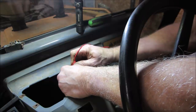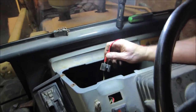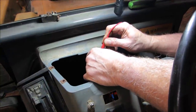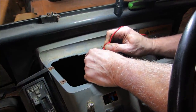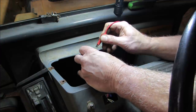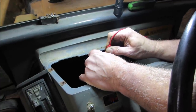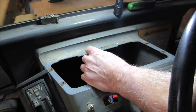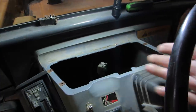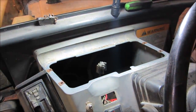The radio comes on. Tries to. And the radio blinks. And if we were to make power going on. So that's a dead short. Wherever that's going, it's going right to ground. So something's an issue with that, whatever that switch controls. That's why it's got no power and it blew out whatever it did. It's drawing just way too much.